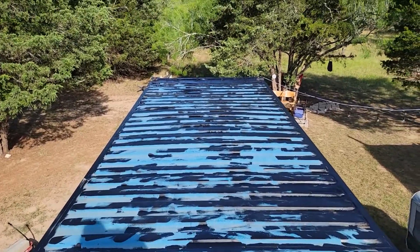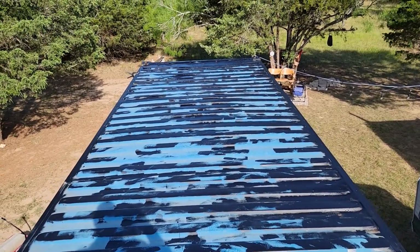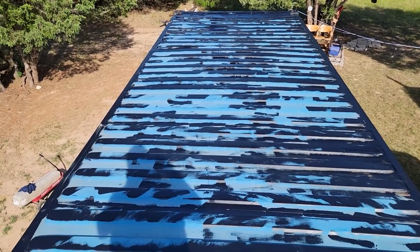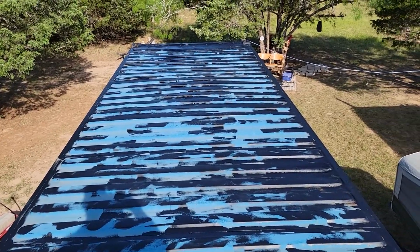The next step, and I hope to have enough energy, is to get the membrane up here. I'm putting 2 layers of infrared bubble wrap and a tarp over the top of it, and that will be on the top, and then I'll put in perlite concrete.